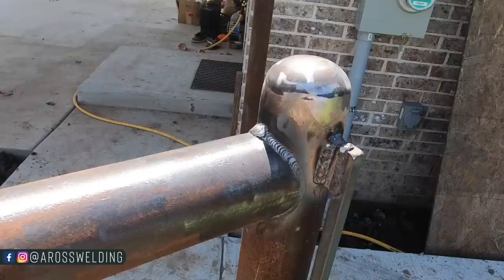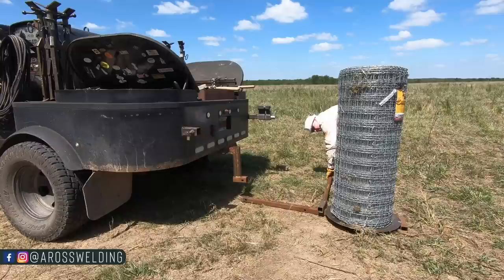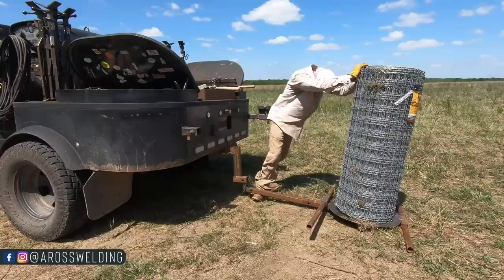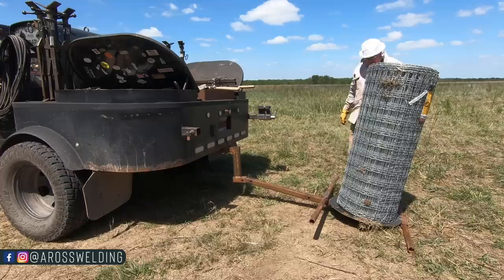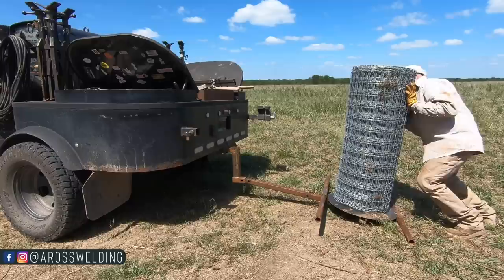Kevin's cousin was here to pester us. Got our caps sanded down, got our rods put on, now it's time to stretch some wire. Here I'm getting prepared to stretch this wire along the barbed wire on the back side of the house. I built this little hoodoo to hold the roll of no-climb — I tacked some square tubing on either side and ran some pipe through it. The idea was to have two people and use the pipe to lift it up into the receiver, but on this particular day I was by myself, so I had to manhandle the roll of no-climb.